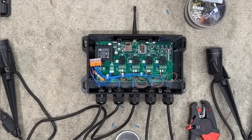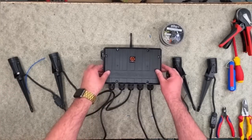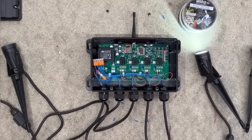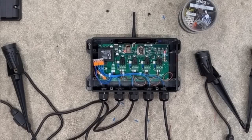There's a rectifier in the front end of each fixture so it's not polarity-sensitive at the fixture end, but our IoT device is. That's all connected, so we should be able to power this up now. You'll see that graphic equalizer jumping around. What I love about all RF Solutions IoT solutions is there are loads of diagnostic LEDs so you can tell whether channels are switched on, whether you're receiving signal, and whether it's connected to the network.